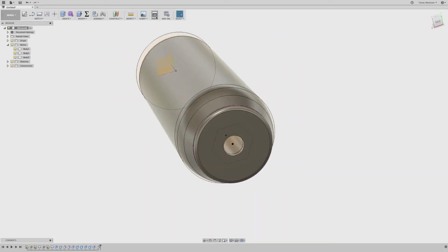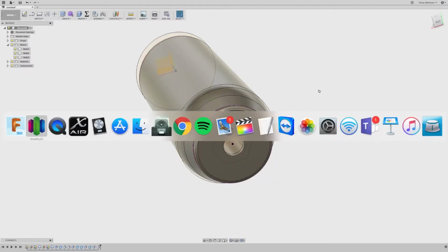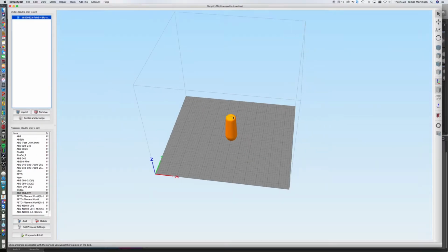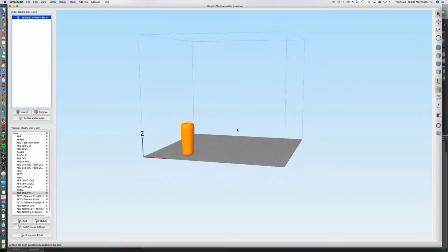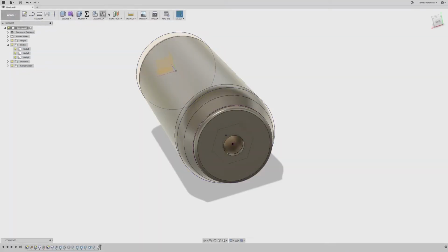It's time to print. Select that big part. Simplify 3D. We need to flip it over. Command L, sorry. Command L, just select one triangle from here, and it puts that triangle on top against the build plate. Command and mouse, move it. It's nice there. Then the next part, make this part.